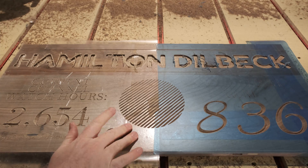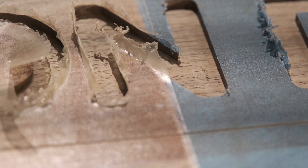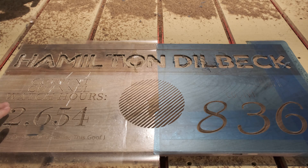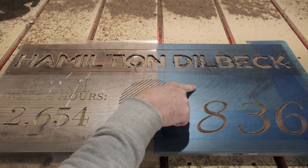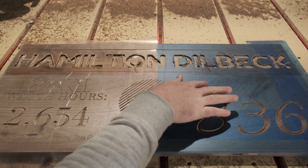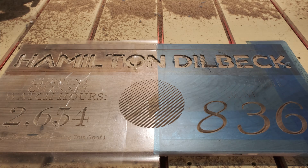I think there is a pretty clear winner. I made some mistakes — obviously do not use an upcut bit because it just rips the masking up. My other mistake was using a piece of walnut that was not completely flat. This section was meant to say 'current subscriber count' and that didn't go very well. I'm going to get a razor blade, clean this up a little, then throw some paint on it and see what we can see.